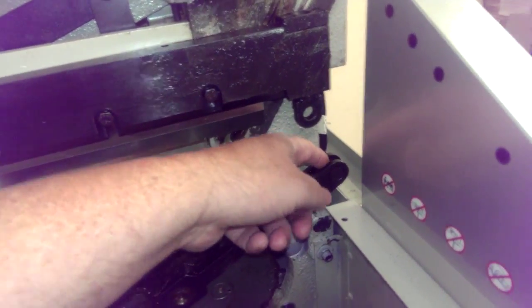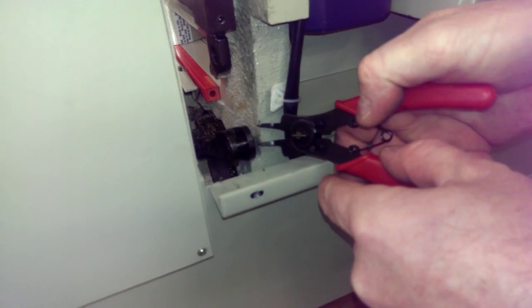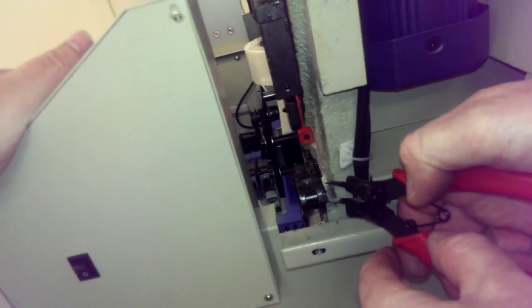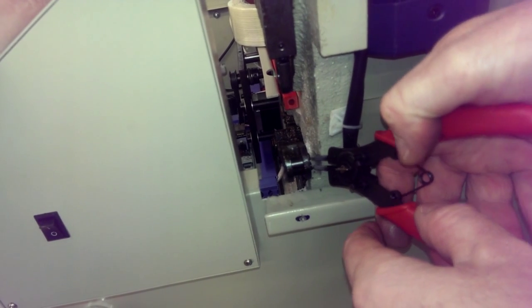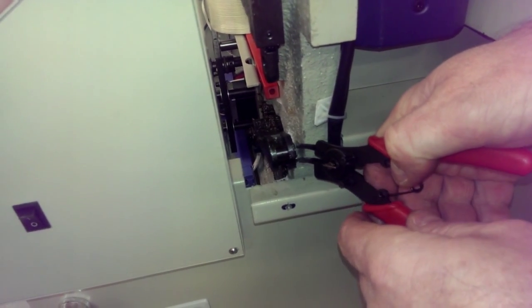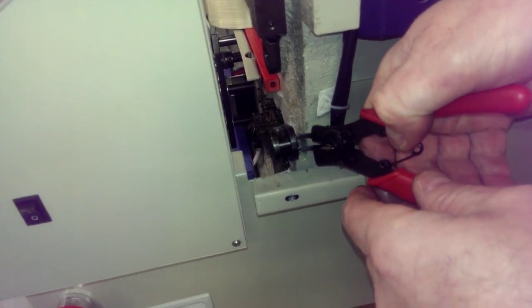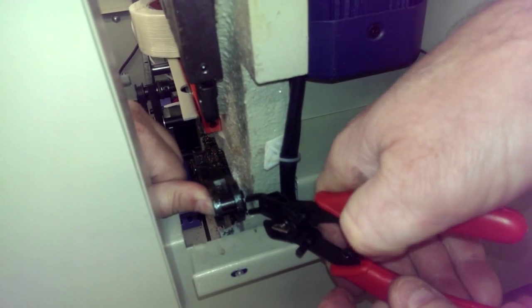So we're going to actually take the clip ring tool. And yep, Chris is just going to take off that clip ring and then get that pin out. This C-clip right here, if you don't have one of these, a lot of times you can just get it off with a screwdriver or some needle nose pliers. You may damage it, but like he said early in the video, sometimes you press against it right here, Chris.